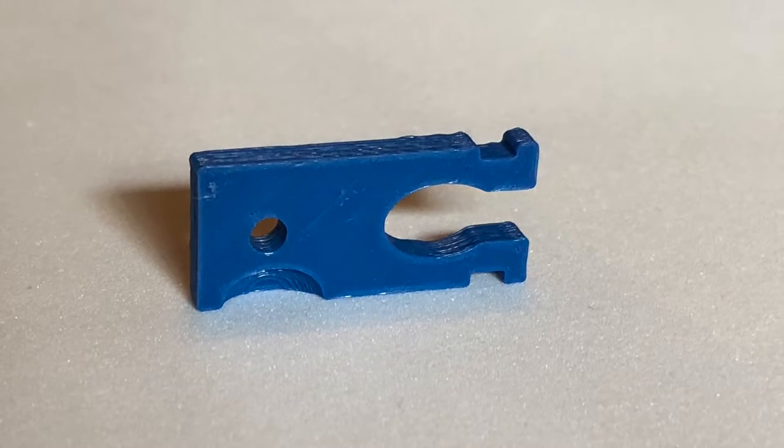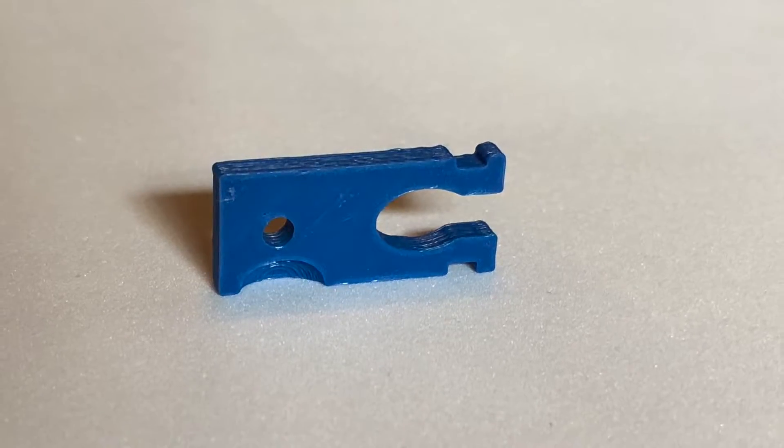One more thing that the kit does not include is some method to attach the mesh cable bundle that goes to the hot end — the one that's zip-tied to the Bowden tube. This is something that the stock extruder does have, so I designed a little clip to serve that function. It's on Thingiverse, and the link is in the description. Print this out before you start the assembly — it shouldn't take more than about 10 minutes. This should be a straightforward process: we'll unload the filament, take the old parts off, put the new parts on, and then we should be able to load up some filament and get printing.